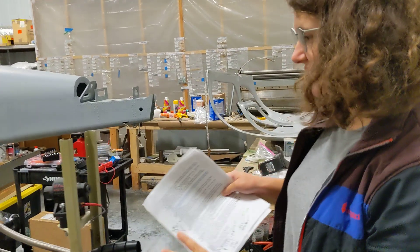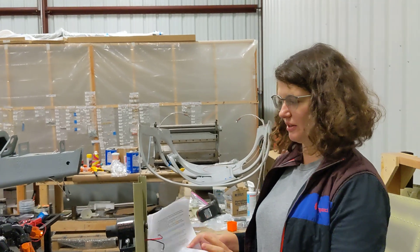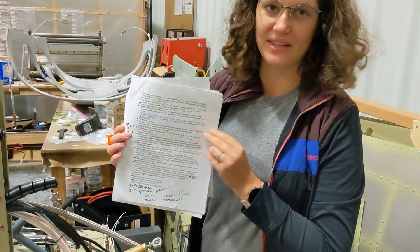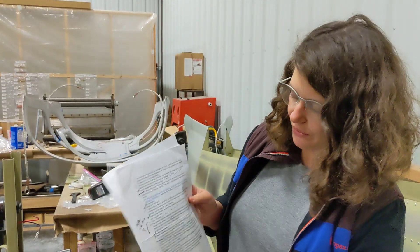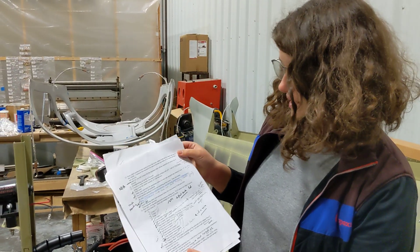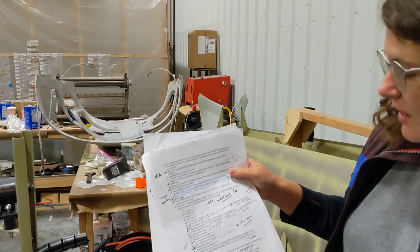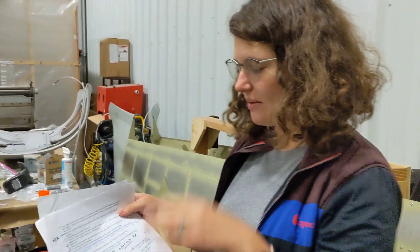Honestly, everything here was a pain in the ass even at this stage — I think you could do it later, but it's going to be even harder. One thing that really helped us — I'll put a link in the description — is Craig Maiman put together a really nice list of things he did in the fuselage and the order in which he did them. Going through and checking off things made sure we didn't miss anything; it covers seatbelts, ELT, backing plates of various sorts. Printing it out and checking through before you put the side skins on is really helpful. Thanks, Craig.